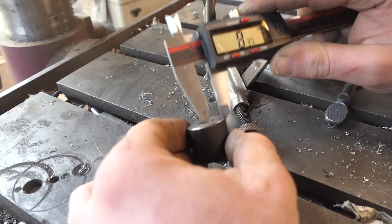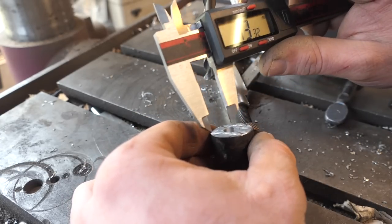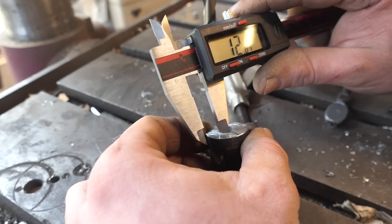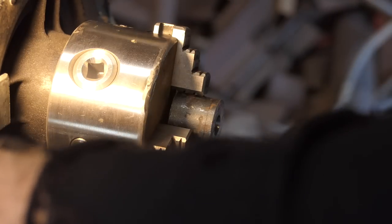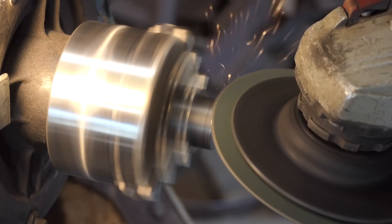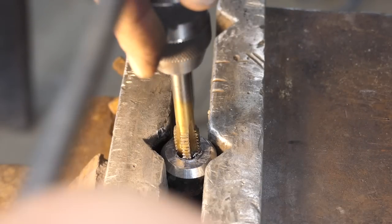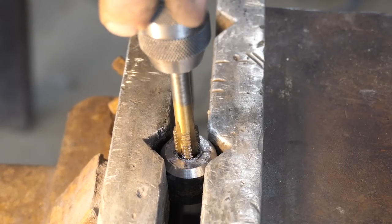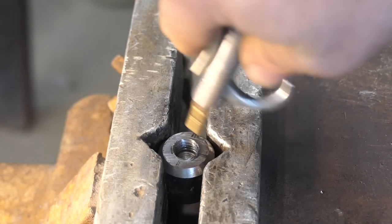Let's see how we did: 7.6, 7.8, 7.7, 7.9? 7.7, 7.8 — okay, there's quite a bit of variance, but I think that's close enough to center for our purposes. 7.6 is a big size for a blind tap, and I didn't have a blind tap so I just chopped the top off my existing one. It appears to be working though.